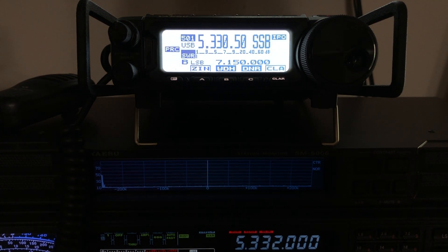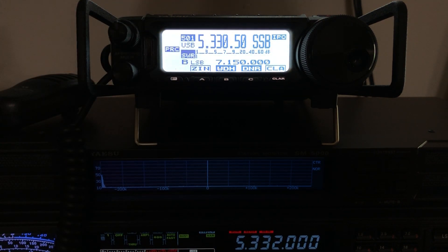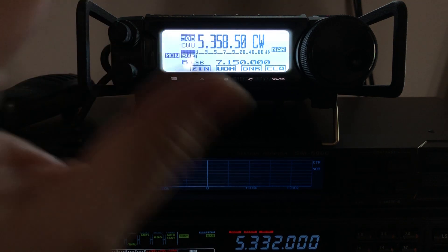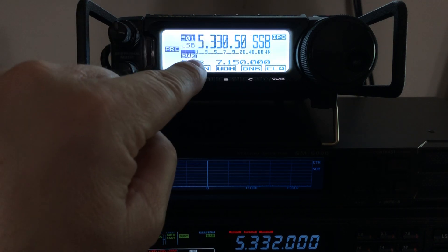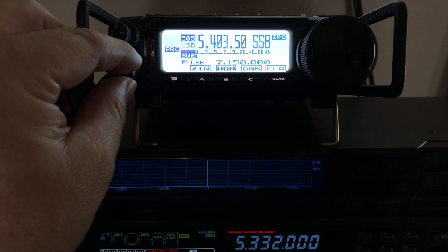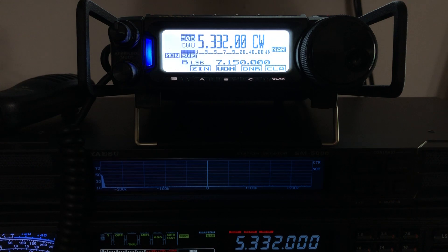I can't do that with the FT-5000 — it doesn't have the ability to assign a tag; all you can do is assign memory numbers. I had a discussion with Yaesu about this and put a bug in their ear: since they're pre-programming these channels and setting it up to keep us legal, why not just display 5330.5 instead of 5332 — put what it really is. But there's that issue with the NTIA requiring the display to show the center of the channel, so honestly I doubt anything will ever be done about that.